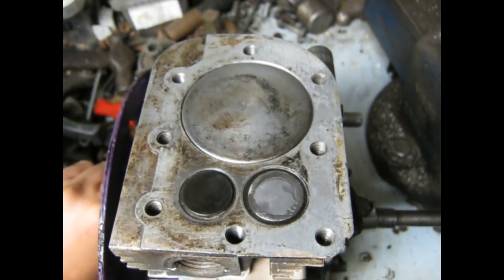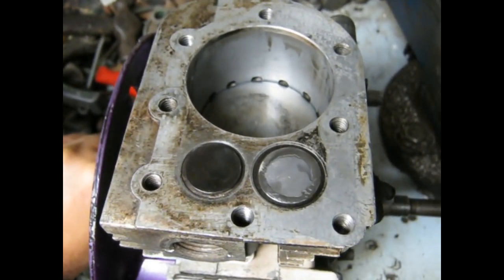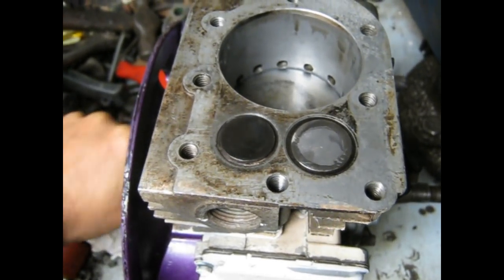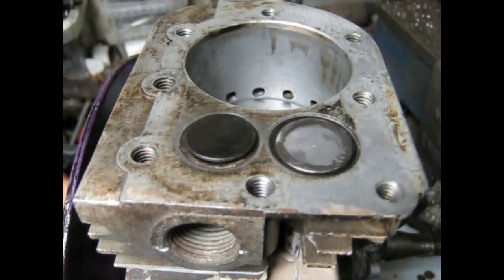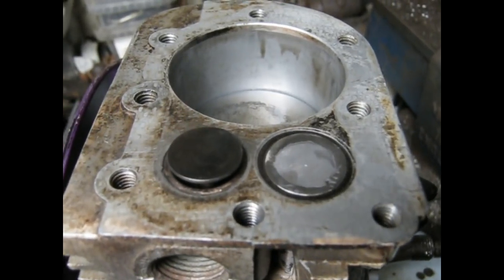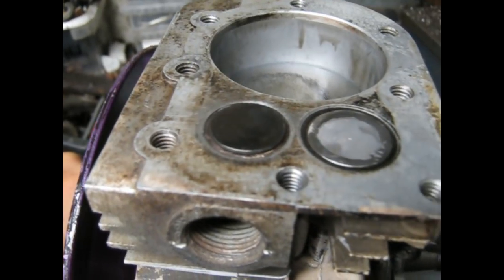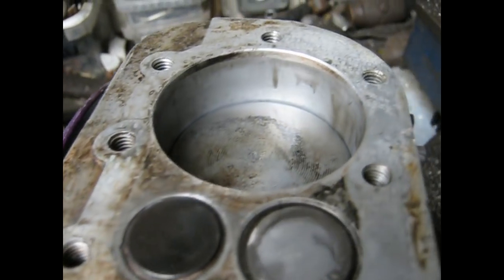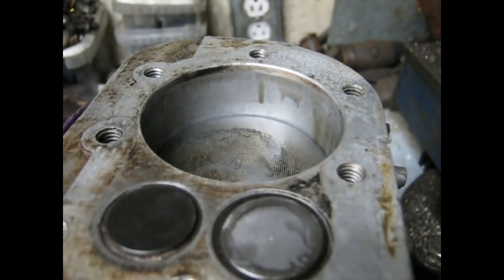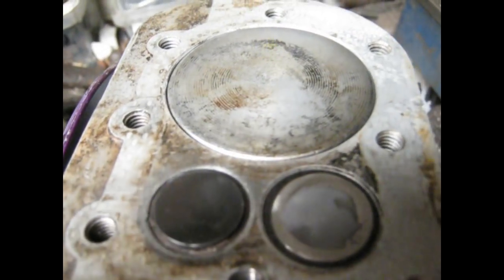With it all assembled I wanted to show you the cycle. It fires, piston goes down, then it uncovers the inlet ports. I don't have quite enough exhaust valve timing — the exhaust valve is starting to open at bottom dead center. You can see it's opening now as the piston's coming up, then it closes up the inlet ports, and then a little while later the exhaust valve is closed. So we've only got about two-fifths of the stroke for compression. That compresses and fires — that's the cycle.